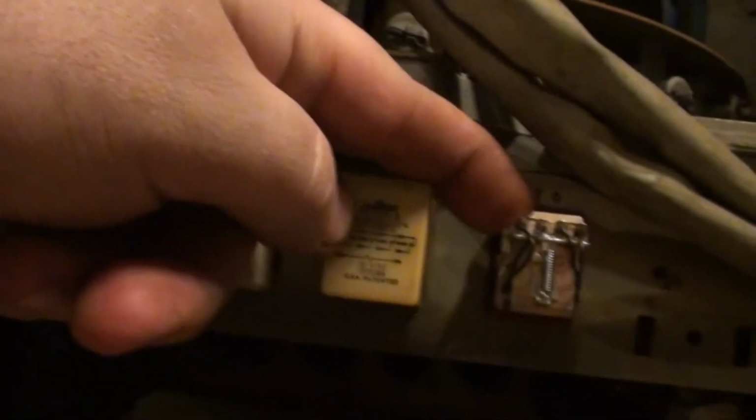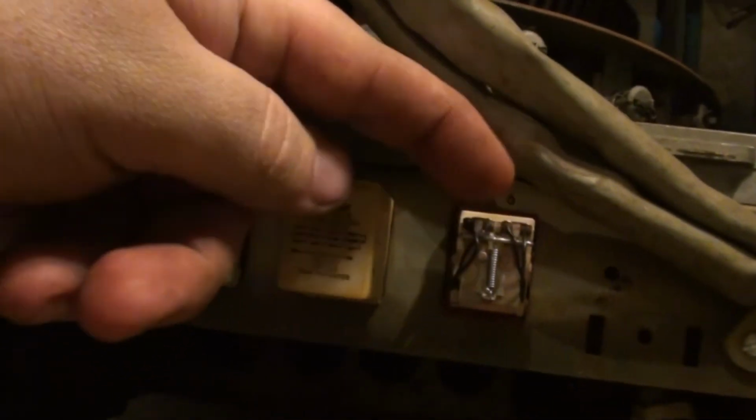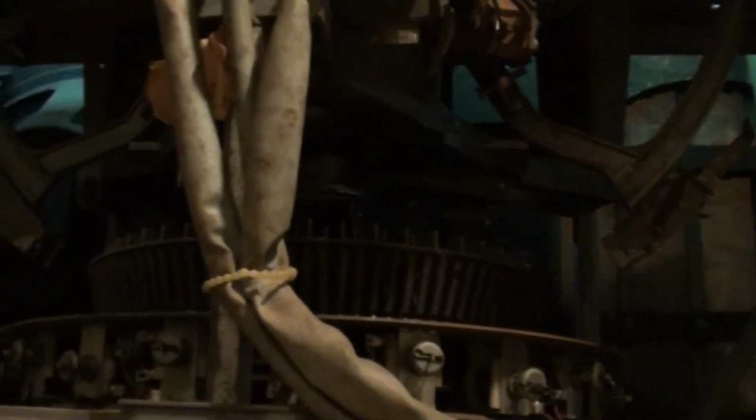And right now, relay number 6 is still dead as a doornail, so somewhere in the sequence, the circuit that's complete up here, that's supposed to help run the motor here, is completely dead. So I would have to, at some point, take this entire unit out of the jukebox. Whenever I get to that, I'm not too sure, but I'm going to have to work with this guy here first, the Seeburg, to see what I'm going to do. But that's where I'm at right now. So the carousel, like I said, is now free to do whatever.